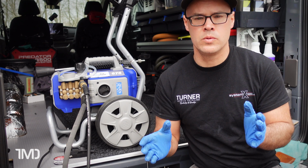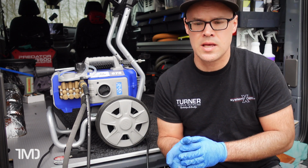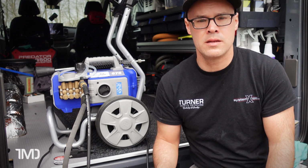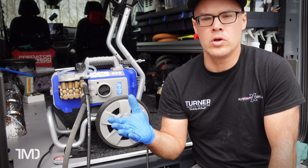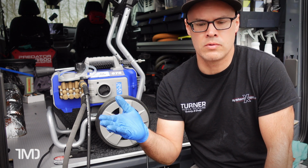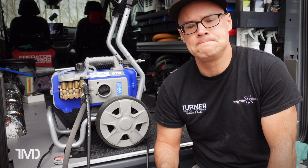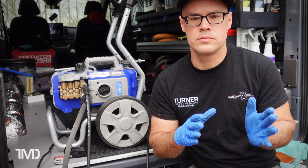Stay tuned to this channel. I'm going to be coming out with another video very soon on how to change the oil on this thing. This thing is due for an oil change. That's the only real thing that they recommend doing as regular maintenance on this machine, is oil. As long as it's 30 weight non-detergent oil, you can get the oil right from them, their crankcase oil. So again, stay tuned for that video. That'll be coming out soon.